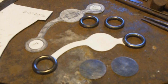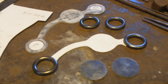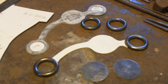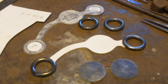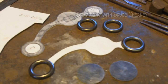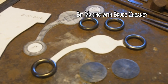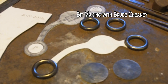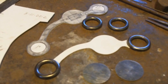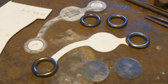I have my silver circles prepped — they need to be domed, but I've got those shaped up. My rings are prepped; I've hammered those flat and pushed the seam together. The only other thing I'd like to do is hit them on a belt sander with a 120-grit belt where the seam is. Now I need to continue profiling the shank bodies.